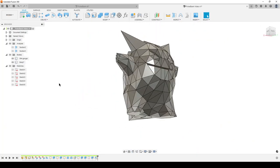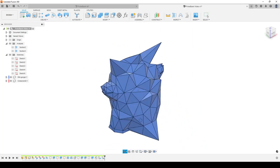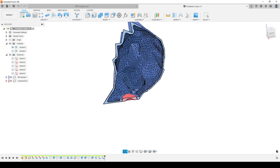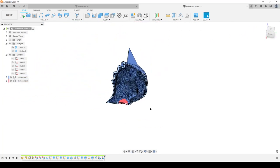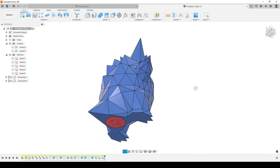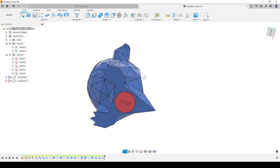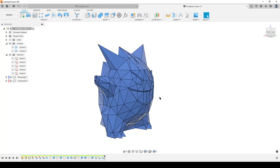I've now made the parts. I started from an STL so I didn't make components from the beginning, but I can right-click and Create Component from Body to split things into two components. Using Shift+N to turn on color coding for components makes it easier to see what belongs where — you can see the slot and the locking mechanism clearly. This is how you take a low-poly STL of a Pokémon and turn it into a piggy bank using Fusion 360's mesh features. I hope you learned something — take care and goodbye.